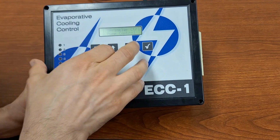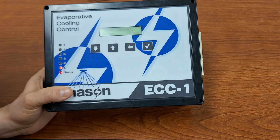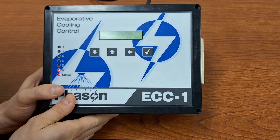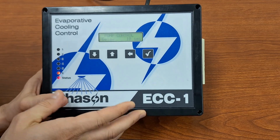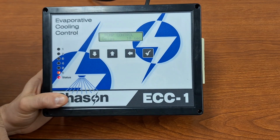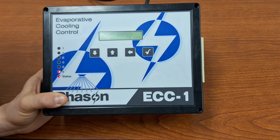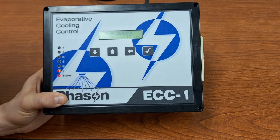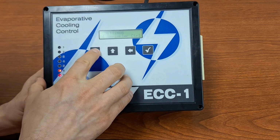We have our pump control setting. In here, you can see we've got our delay set to 10 seconds, and that's exactly what I was talking about before, where we will give 10 seconds right at the start of the cycle where our pump relay will turn on, and we'll wait those 10 seconds before we turn on our first soaker relay, just so that our system is pressurized.